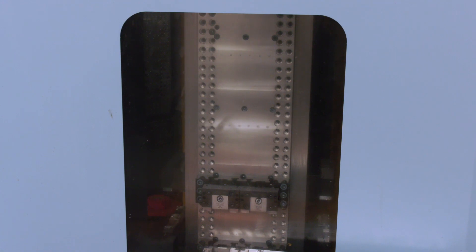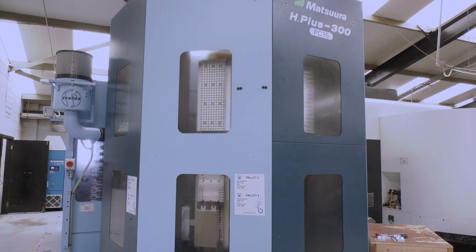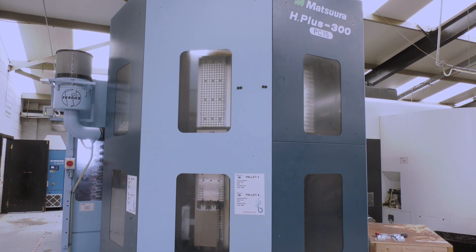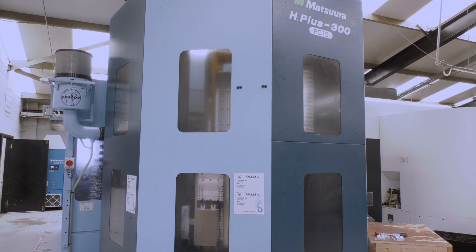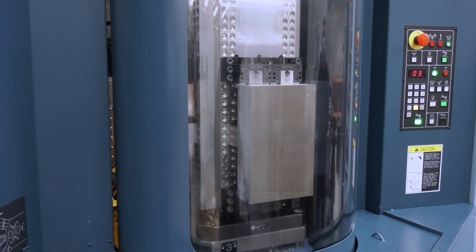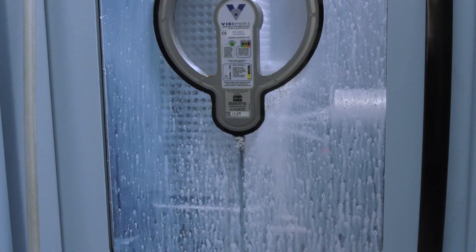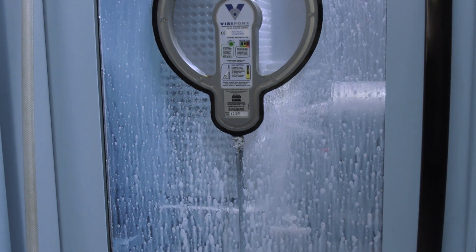How's your setup — I can see some tombstones here, what type of work are you putting on there? We vary. We've got one pallet where we can do vice work, we've got tombstones for bigger billets, and the rest are cubes so we can do four sides on any size billet really. It's a 15-pallet machine — how does that help you? It's brilliant. One pallet is running and whilst that's running I could be setting up multiple pallets at the same time.